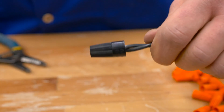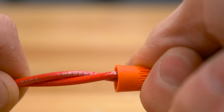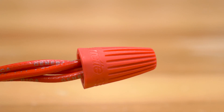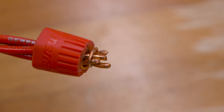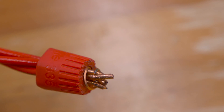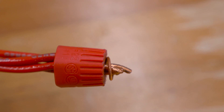And it's that easy! Depending on the type of connector you have, you can connect two, three, or even more wires together. Also, if you're reusing the XTP, winged, and high temperature connectors, you need to cut and re-strip the wires before twisting them in again to ensure the best possible connection points. That's because the internal spring could leave little nicks or scratches in the wire, leading to a less efficient connection if you've just reused the wires without trimming.